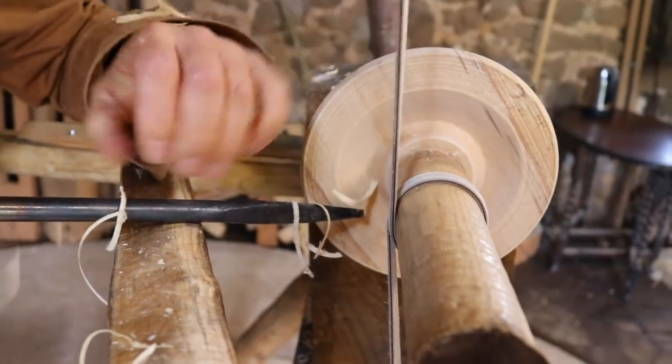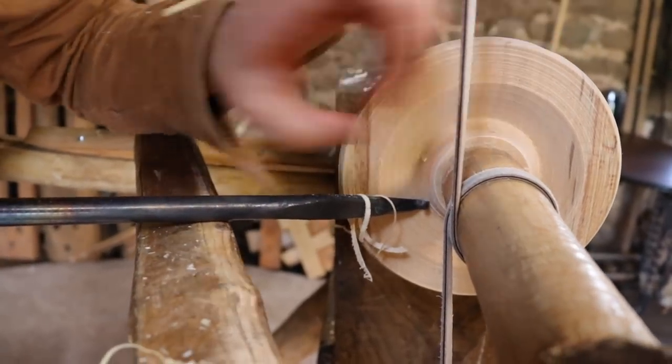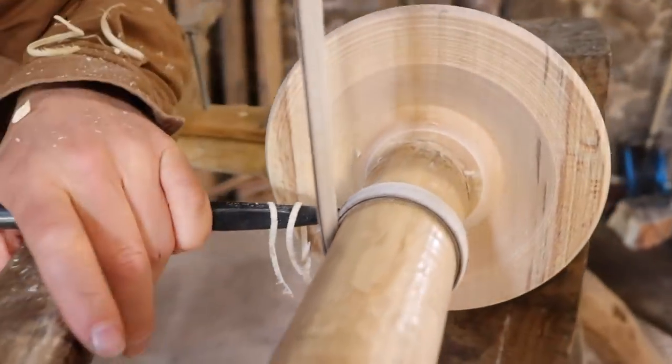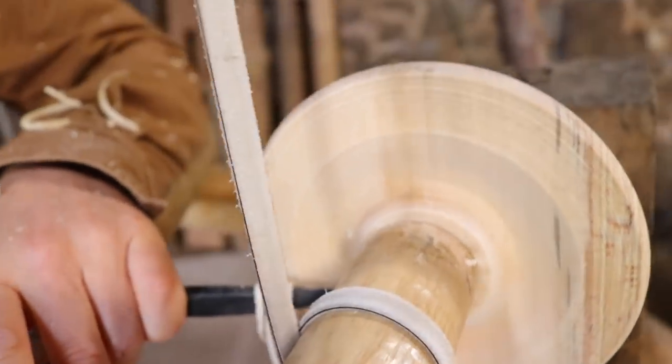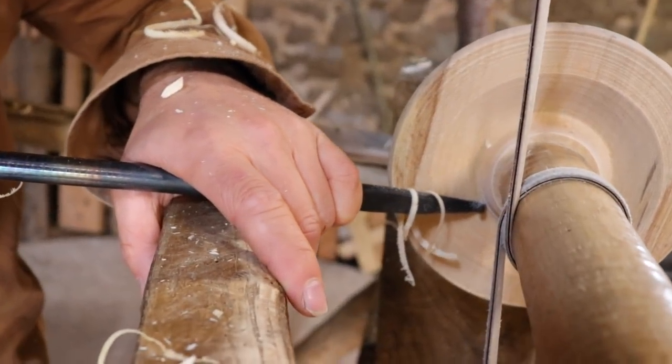So far I'm going downhill. As soon as I start to go uphill again, this section around the mandrel is now flaring out a bit like a trumpet or something, which means that as I get closer to that, the tool starts wanting to go uphill, and then it will dig in and bite, which you want to avoid.